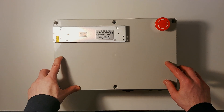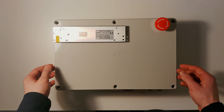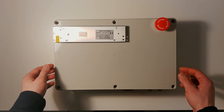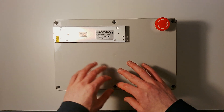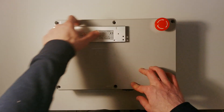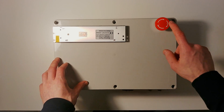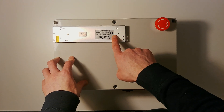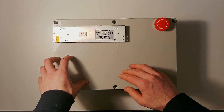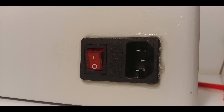In here is an electrical box. This houses all the electrical components used for transmitting power and controlling the robot arm. The first thing you'll probably notice is my lack of measuring skills — this power supply was originally meant to be sideways, but now it has to be flipped up to make room for all the other components, so I had to make a cutout so it kind of sticks out from the top of the box. There's also an emergency stop button here, wired to the live cable going into the power supply, so hitting it cuts power to everything inside. In the top right there is an IEC connector that takes a regular 3-pin power cable.